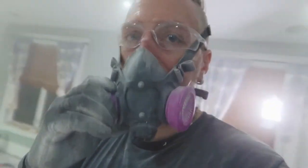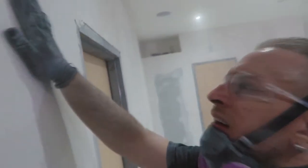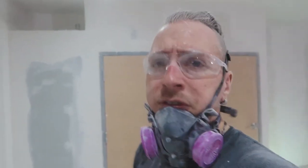Not bad. It's almost there. We're not necessarily level 4 just yet. Especially here in the beginning, I'm not sure if that comes across on camera, but there are imperfections that are just from my crappy mud work. But over here, as I progressed, I had gotten better. It's tough to get these wider strokes really nice and even, but for the most part I would say it's pretty good, like 85% there to level 4.